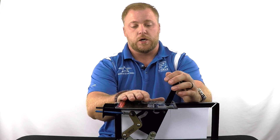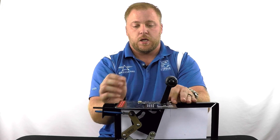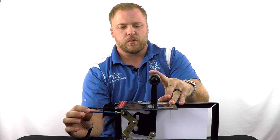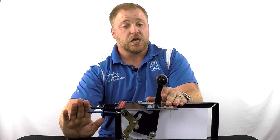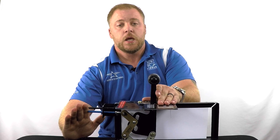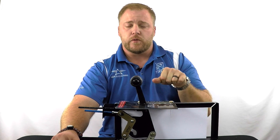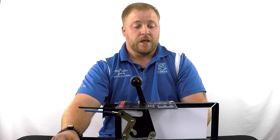So here we're at idle — say 700, 800 RPM. As you advance for takeoff power, we're going to start bringing this up. As we advance this, if you watch the cutout, you're going to see it slowly start to move the prop forward. It's going to continue to move the prop forward, and then it's going to stop. About right there, the prop is actually going to stop — it's not going to be advancing the RPM any longer. So you're going to have this long duration at 2,500 RPM, approximately. And then at the very end, you're going to get that extra 200 RPM — just the last half inch or so advances from 2,500 to 2,700 RPM. That's what you're feeling.